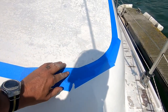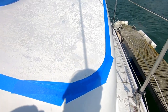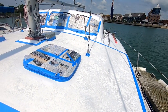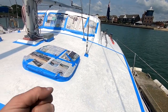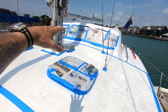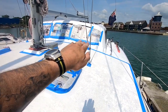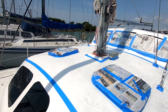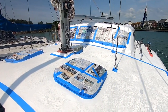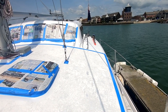So I'm going to do a walk around with a camera. I realise I've missed stuff, so I'm going to cut this line a bit better. Then I mix the paint up really thick with the resin roller again. Roll it on thick, starting from the high bit in the middle. Sprinkling as I'm going, a little bit sprinkled, a little bit sprinkled, maintaining that wet edge all the way down both sides, and then leave it for 2-3 hours, sweep off the excess sand, and reapply paint.